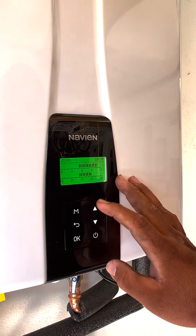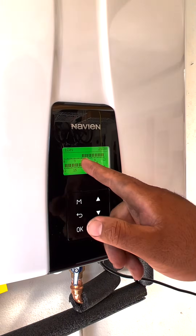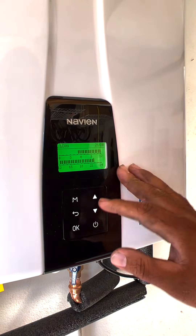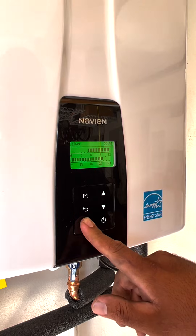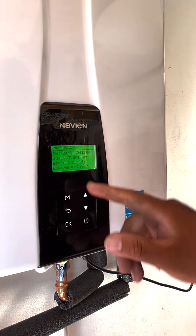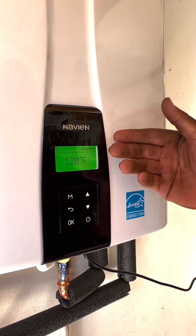What time? Let's do 10 — 10 p.m. So we'll just keep going. From 5 a.m. to 21 or 22, which is 10 p.m. So your recirculation timer is going to be on from 5 a.m. to 10 p.m. Once you have it set, you'll hold OK. And then it takes you to the settings, bypass, and you're all set.